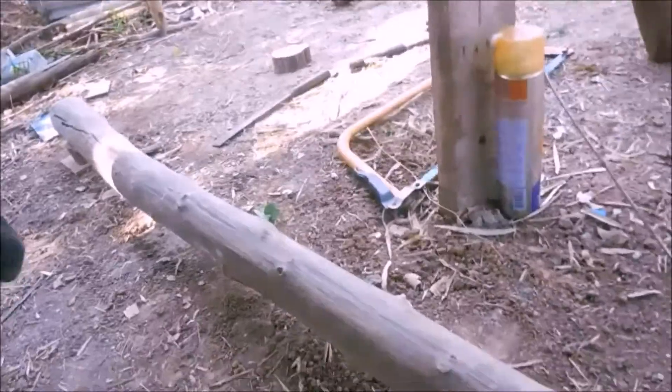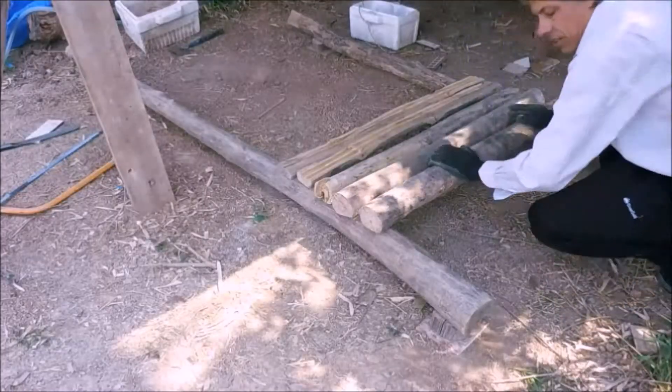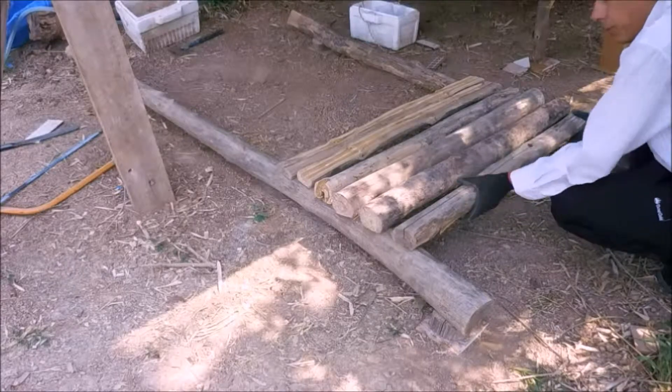The majority of the support beams are now nicely off the ground. I've got this one — the second method — in from the end. You can see that's the sort of cut I've got, with a planed flat portion. By having the stumps in from the end you might get a better span and better support. I've put four stumps underneath my support beams. Let's put my floor back on.